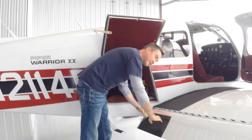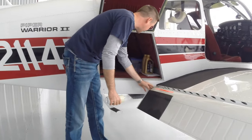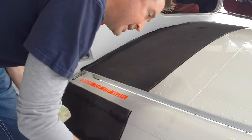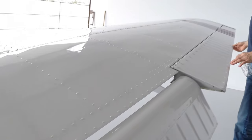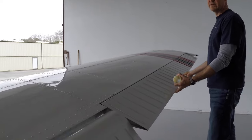Okay, so I'm just going to take a look at the flap. Check the actuating rod here, making sure it's secure, making sure the bolt's in, the cotter pin's secure. I'm going to look down, I'm going to check all the hinges, bolts in all three hinges. They all look good. Okay, we can see that. So that's our flap. Moving on to the right aileron, just going to move this back and forth gently,